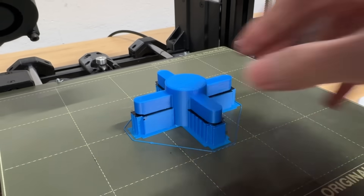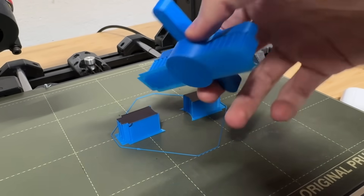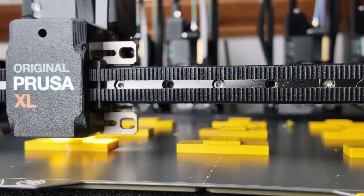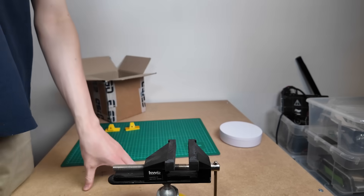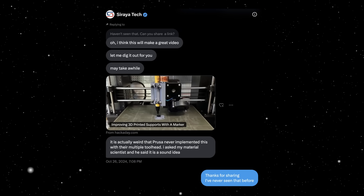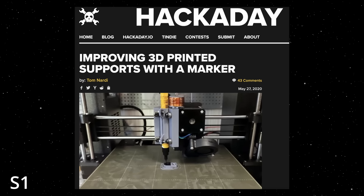In addition, the separation gap can be set to 0 mm, which means the bottom surface of the component turns out smooth and dimensionally accurate. The challenge is to find a release agent to which the filament adheres just well enough to be printed on, but still allows for easy removal afterwards. I first came across this concept thanks to Mark from Ciriatec, who sent me a link to a fascinating post on Hackaday.